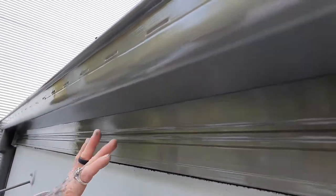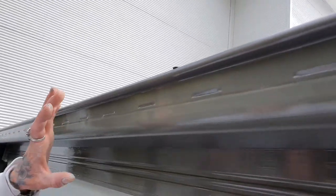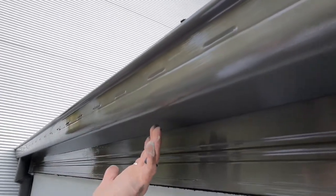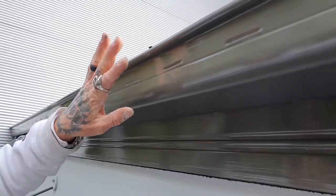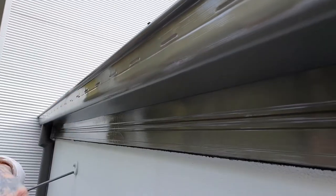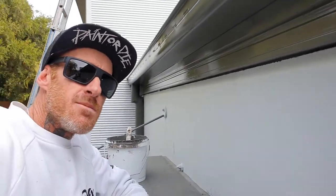As you can see, I've got a nice finish between my gutter and my fascia. Nothing's dried out. If you're painting your face first and then you do your underneath edge, potentially if you are working in the sun, you already have your face dried before you'll actually even get to the bottom edge. So this is a quick, easy, and efficient way that eliminates that problem, and you get it done with a nice, beautiful, seamless finish.